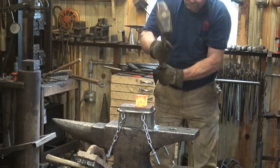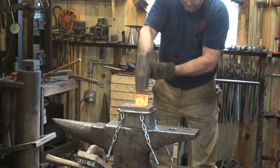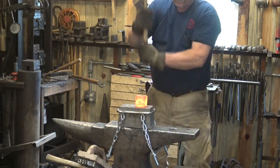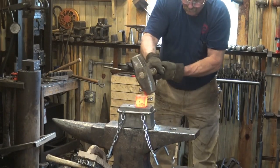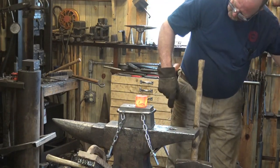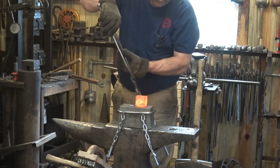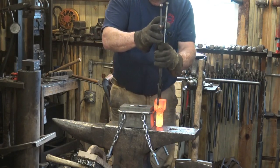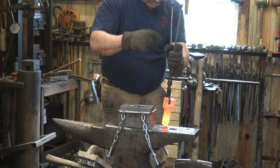It's hard to create a perfect shoulder on the power hammer, so putting it in the anvil block and upsetting it creates that perfect shoulder. It's really quite a nice way to do this. It also spreads the material out and gives me a little bit larger block. This block will be what I refer to as an anvil block, and is just a supplemental forging surface